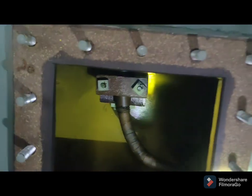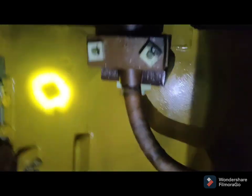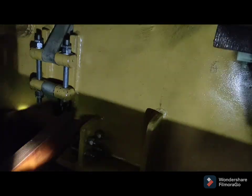You can see the flashings and the carbonized matter all over the transformer. The transformer oil has been collected from the top and the bottom also, and the supporting woods have already been cracked.